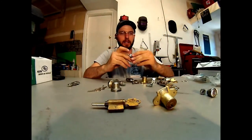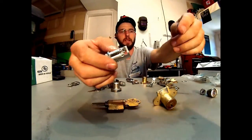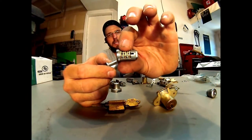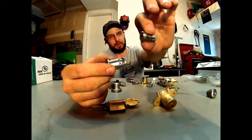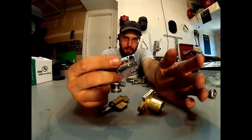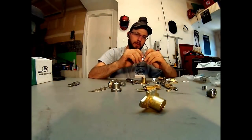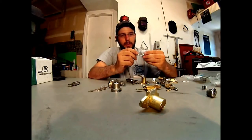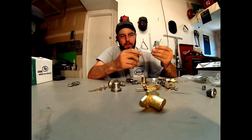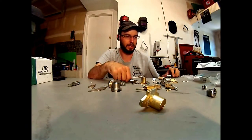These little keyways are more difficult to pick than the wafer and they're just more tolerable. And they're re-keyable. You would have to buy a special kit to re-key these for each brand that you service, whereas with pin tumbler locks you can buy a small pinning kit and re-key them just like any home or business lock. So I always try and find and use pin tumbler locks for my commercial customer base, even if it's on a filing cabinet or whatever it may be.